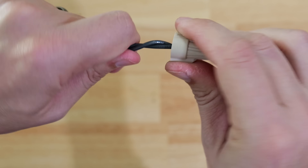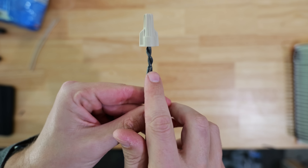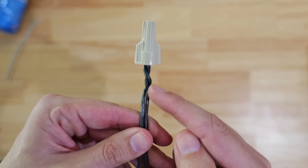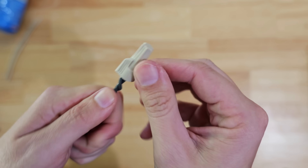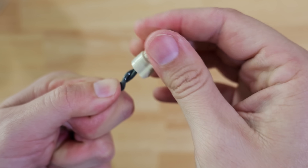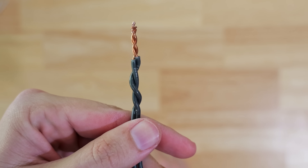As you can see, I've got some nice braiding going on down below the wire nut. Not only are you going to get support holding the wires together down here below, but if we take this wire nut off — or for whatever reason this wire nut was to fall off — once we take the wire nut off, due to us twisting it the way that we did, it has formed a joint between these two wires.